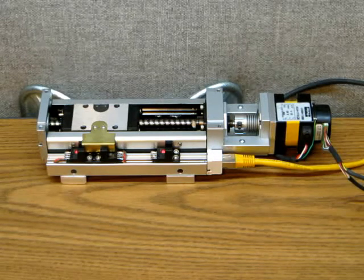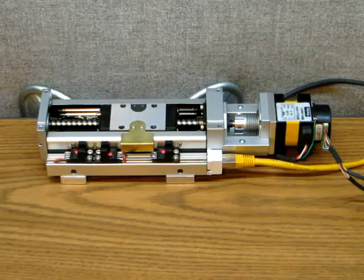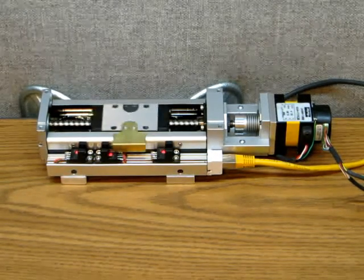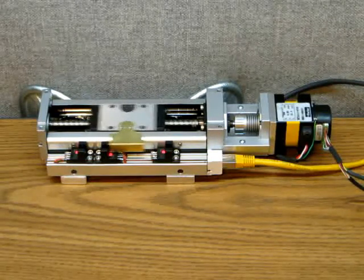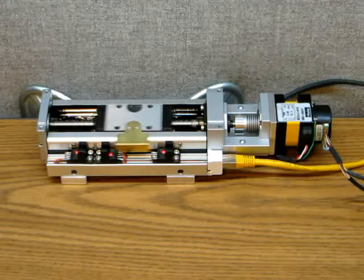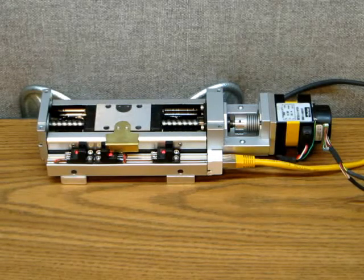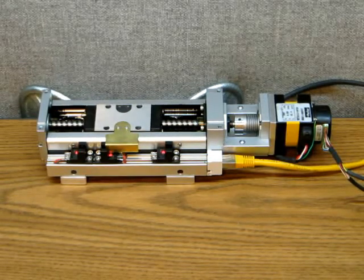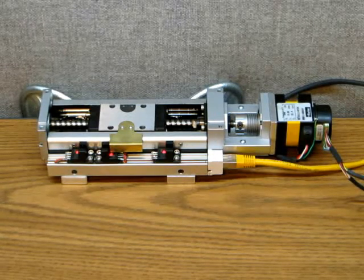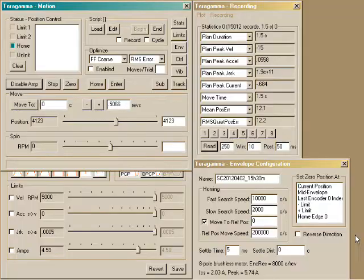Self-commissioning automatically finds the locations and polarity of all limit and home switches. These locations are used to safely create and limit motions during self-commissioning. They are also used to automatically generate a homing procedure that provides maximum repeatability. Teragamma software has solved the chicken and egg problem in automatic system identification, generating safe motion to stimulate the system when not much is known about the system. More knowledge allows generating better stimuli, which allows identification of better models, which allows, well, you get the idea.